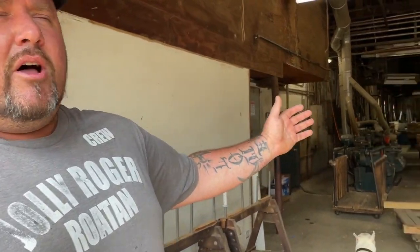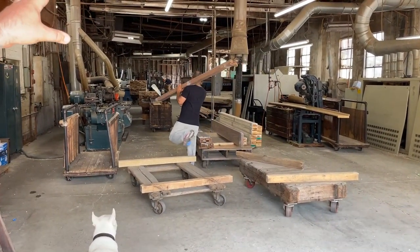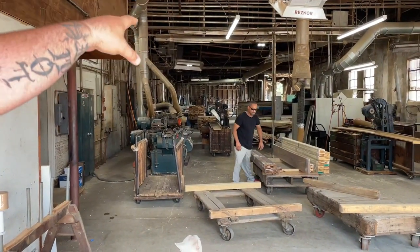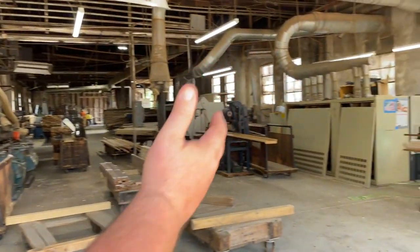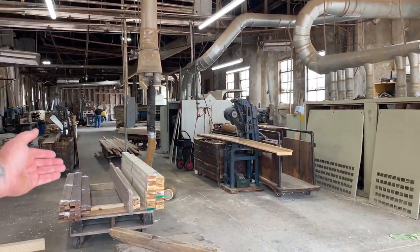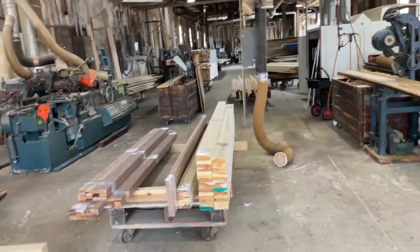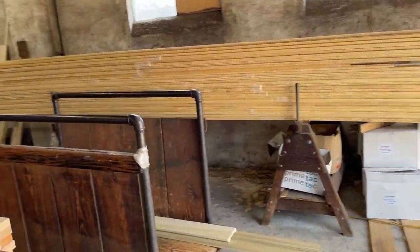This is the mill where everything is made. Everything starts at the far end — brought in very raw right from the saw mills, still very rough cut. Down at the end are the rip saws, which size everything width-wise, then the planers sizing for thickness — basically making a molder blank for the molders to put the profile on. Right now they've been doing everything from door casings to online flat stock.